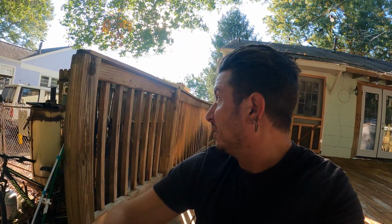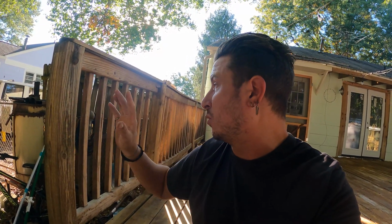We're at the railings, and we're going to break that out because railings are their own little devil. You know what I mean? They have nooks and crannies, and a lot of them. And there is no good way to do railings that I'm aware of. Brush takes forever. Some people say use a sprayer, but if you're using an oil-based stain, which is what I am going to use and highly recommend, cleaning the sprayer is going to take even longer than using a brush. So we're not even going to deal with that because I wouldn't clean it, and that sprayer would become a one-time use disposable.